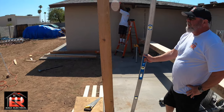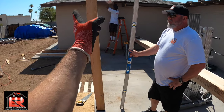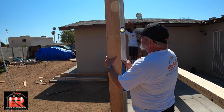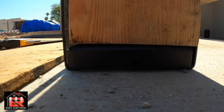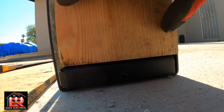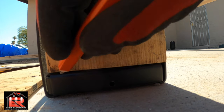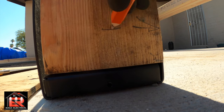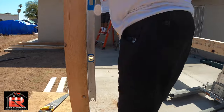The post is naturally sitting crooked, so go ahead Savage — make it straight, level, plumb. We got it pretty plumb but we look down here and there's a gap. The structural integrity is relying on the back side of the post. So we're going to match that gap on this side and cut it at an angle so when it naturally sits on the base plate it sits level.